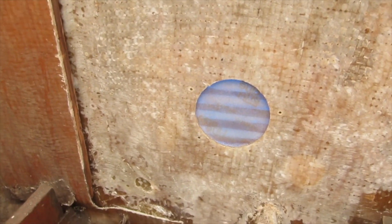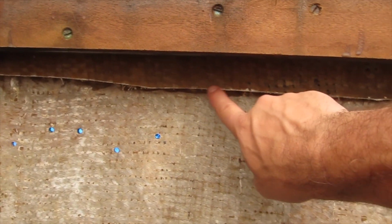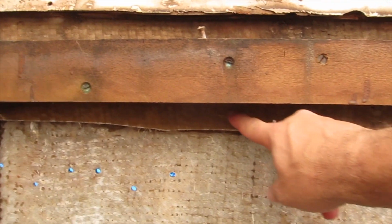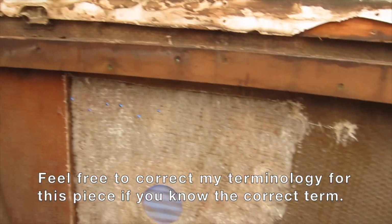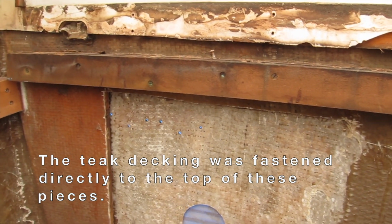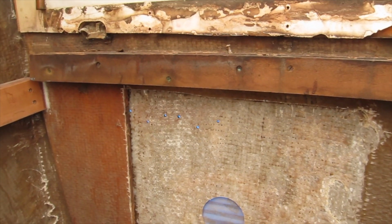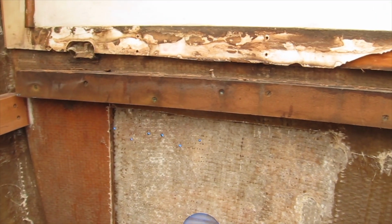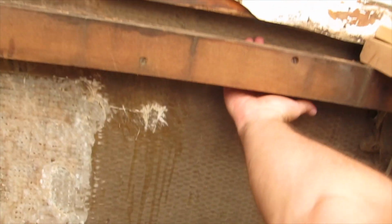So anyways, I got that mostly taken care of, but the problem is on this side, especially up underneath this piece, there should be plywood here to hold this piece on, but I'm not feeling any until way up near here, and I don't like that. So I think what I'm going to do is take off the ledger board, or the 3 ledger boards that are there, just unscrew them all the way down the other side too, and cut that fiberglass behind them away to see what the condition of the plywood is behind there. This piece on the end here is okay, so hopefully it's as good as that, but it's tucked up way in there, and I just don't feel comfortable with it. Probably will replace it all the way along the back, although there's no piece here.